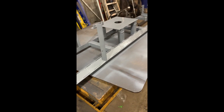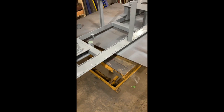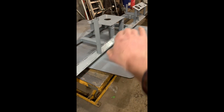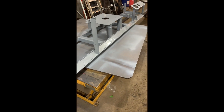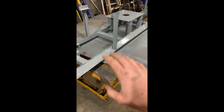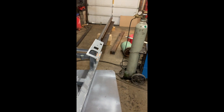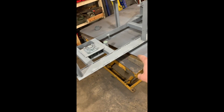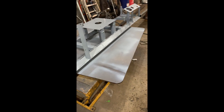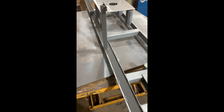I added in a piece of plate all the way down the length to box in this angle iron, because when I finished welding everything and looked at it, the whole thing was bowing lengthways — kind of had a crown in it. I had a big heavy-wall piece of tubing as a straight edge, welded the plate on, but it was still bowed. I made relief cuts, heated it, and played with it for a while.